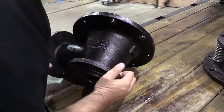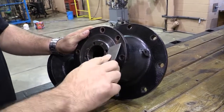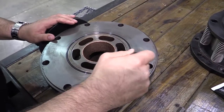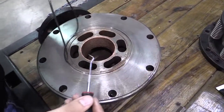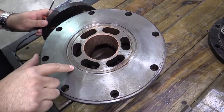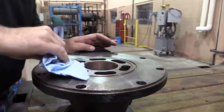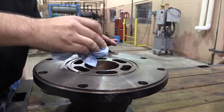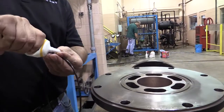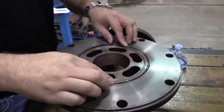Inspection. Other components. Body. Remove the O-ring from the face of the body and discard. Inspect the O-ring groove for pitting or steam cutting. Inspect the steam flow ports for erosion. Clean the gasket surface. Replace body if any area is damaged. Lubricate and install a new O-ring into the O-ring groove and set the body aside.